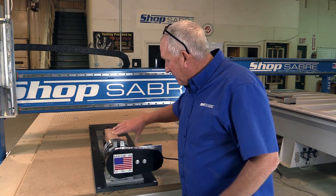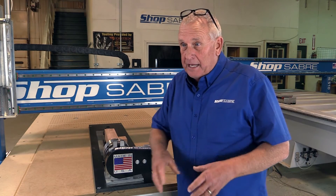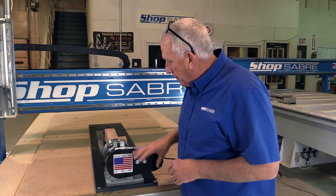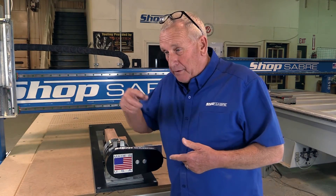The heart of this is actually the chuck — a machine tool chuck. It's a four-jaw chuck, and the benefit of that is it's really easy to clamp square stock, rectangular stock, or unusually shaped pieces. What makes it actually turn is a belt drive system. A belt drive system has no backlash, so I don't have to worry about gears meshing and play. It also allows me, because it's a belt drive, to actually spin that at a constant RPM if I wanted to.